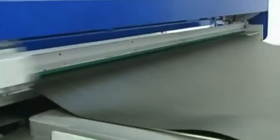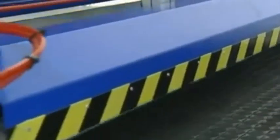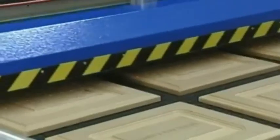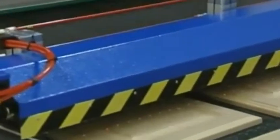The feed unit is made up of a lift platform, side rollers and chains, a bar to spread the coating sheet, and a cutting unit. The bar moves on ball recirculation guides and is equipped with an optical scanner to read the position of the panels on the tray waiting to be fed in.